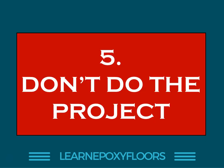Number five, which is not really a solution but may disappoint you: sometimes you may just not want to do the project. If you're seeing too many problems, if you've tested solutions and moisture keeps coming back and nothing seems to be working, that is a solution too — don't do the project. I know you'll disappoint your customer and you're after the work, but if things just don't fit, avoid the project because you'll get yourself into trouble. I get a lot of emails from people saying they applied epoxy and two months later the whole thing is falling apart. Don't do the project if it's not in your best interest.